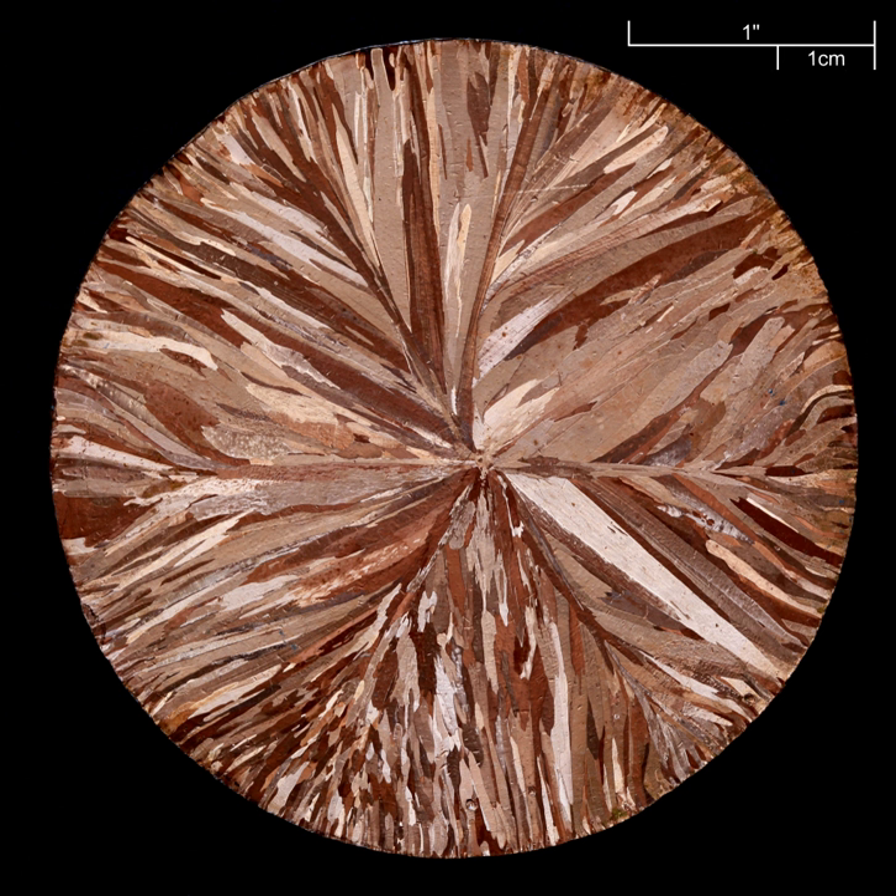Cleaning is the preparatory process of ensuring that the surface to be etched is free of contaminants which could negatively impact the quality of the finished part. An improperly cleaned surface could result in poor adhesion of the maskant, causing areas to be etched erroneously, or a non-uniform etch rate which could result in inaccurate final dimensions. The surface must be kept free from oils, grease, primer coatings, markings and other residue from the marking out process, scale, and any other foreign contaminants.